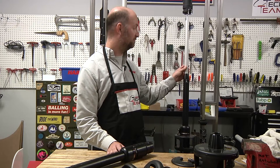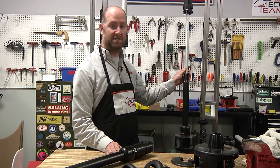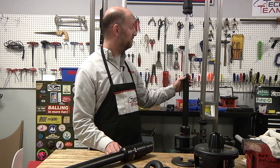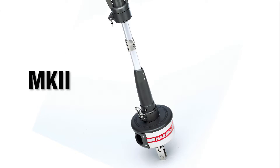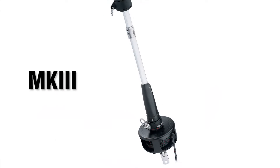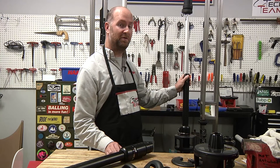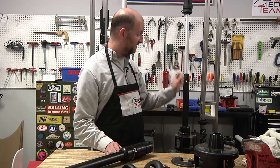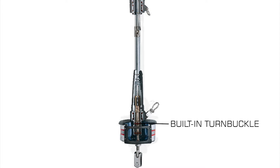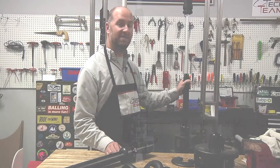Our current line of performance furling is what we refer to as Mark IV. The first vintage came out in 1984 and started with a Mark I. No matter where you walk up and down the docks at any marina, you'll still see lots of Mark I, Mark II, and Mark III furlers. Harken came out with the Mark IV line in 2006. The biggest difference between Mark IV and all its predecessors is that the old furling had a built-in turnbuckle, whereas Mark IV provides a standard turnbuckle body, which is much easier for adjusting headstay tension.